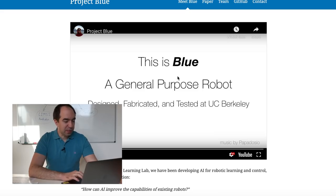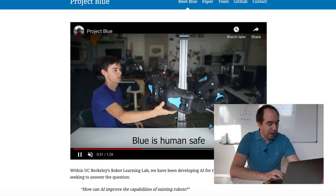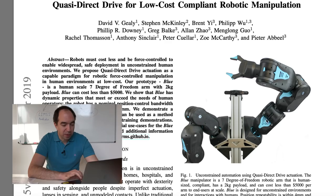The next robot arm is called Blue — just Blue. This is a robot arm from Berkeley. As you can see, almost the entire arm is 3D printed. It's a highly back-drivable arm. Looking closely: this is axis number one, which has one degree of freedom at the base. Afterwards it has three identical modules — one, two, three. So the construction is quite simple: one base and three identical modules. They published everything in a paper, which is publicly available. They use quasi-direct drive with a reduction ratio of a little bit more than seven. The payload of this arm is two kilograms, and they expect it to cost less than five thousand dollars.